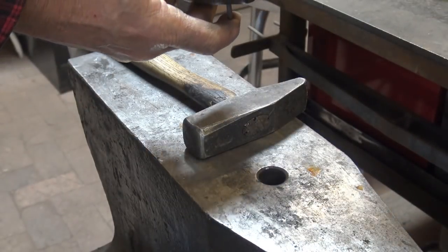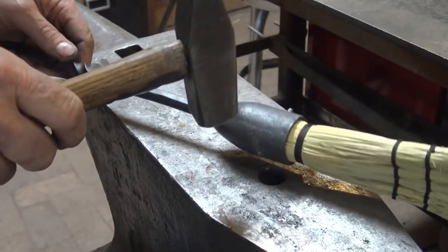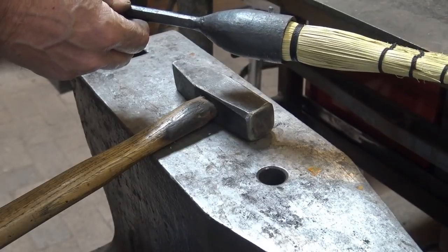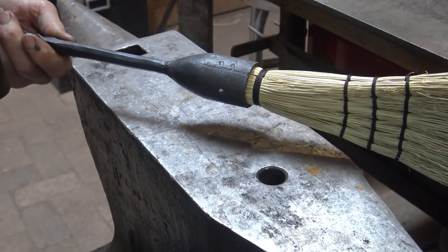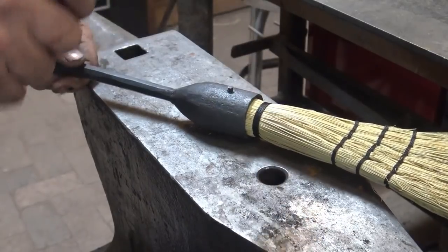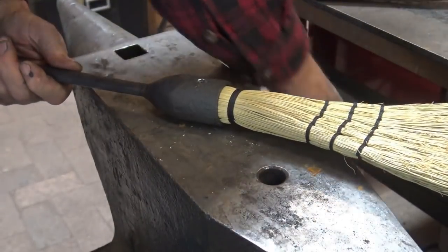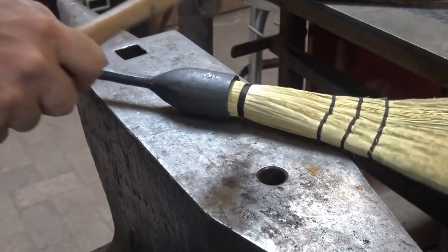Using a V-block to hold the round bar helps this come through straight across on the backside. I actually want to countersink this a little bit to give the rivet head a place to go — make a nice tight attachment. I have that pin in there, and it should come right through the other side if I did everything right. I think that's a little long, I'm going to grind some of that head off. I want kind of a flat head rivet here. I've got about 3/16ths sticking out each side for a flat head rivet. When you rivet this, you want to be fairly gentle, or you can end up bending that rivet down inside the piece.